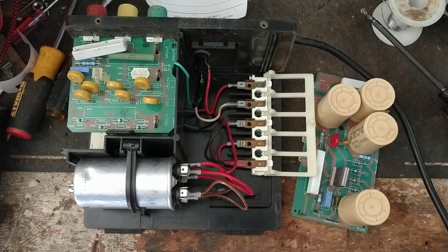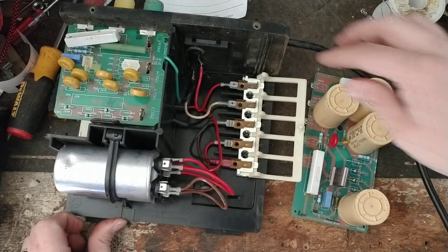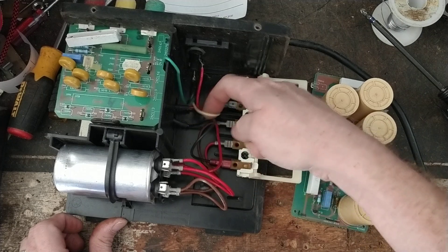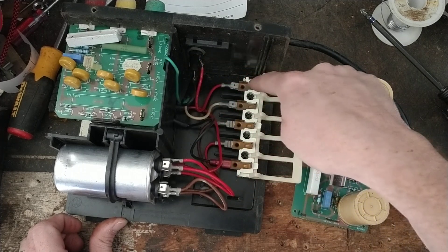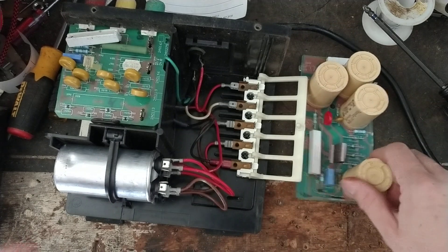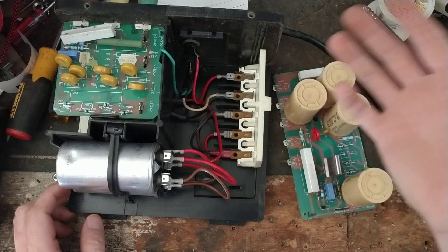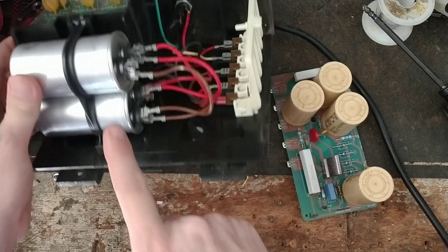This will apply to any make, model, or brand of electric fence charger — the current style that's been around for about 30-something years. Power comes in right here on this 110-volt AC version. The neutral side and the hot side of your AC come through, the hot side goes through the fuse and over to this side which powers up the board. The board has four big capacitors, and this builds up the charge gradually through these capacitors.